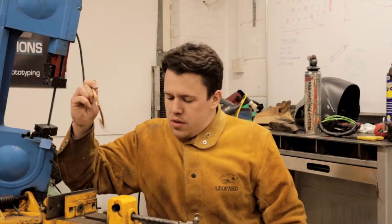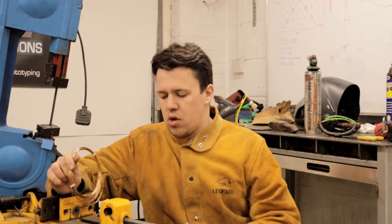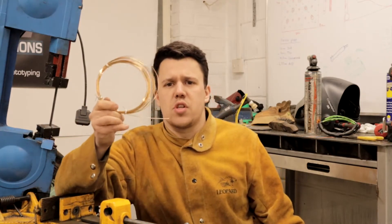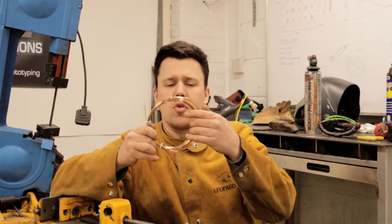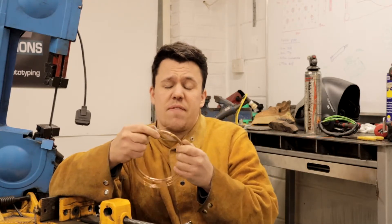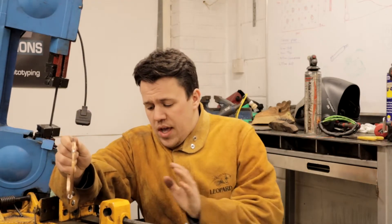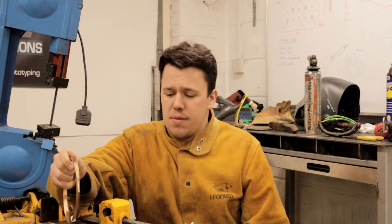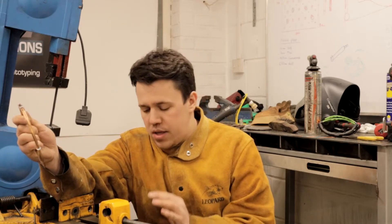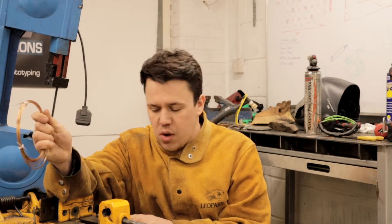Just like that, the welding's done. We've got it all welded out — very happy with it, it's nice and solid. I've let it cool down and it's looking good. All we've got left to do is throw this back together. This was my first time using phosphor bronze TIG wire and I'm really impressed with it. It's TIG brazing rather than fusion welding, but it flowed like standard filler metal, so I can't complain. As for the repair, time will show — let's see how long it holds out. Welding cast iron vises is never ideal, and TIG brazing isn't the conventional way to do it, but it suited me and my setup.